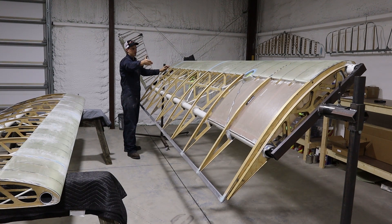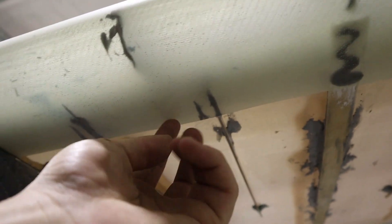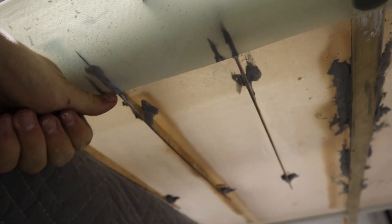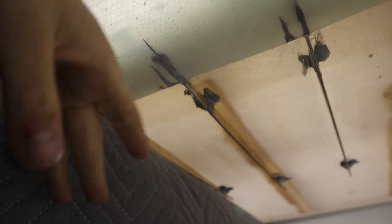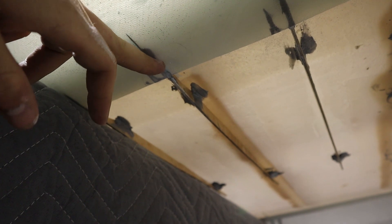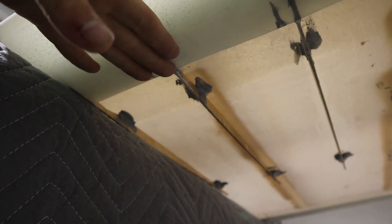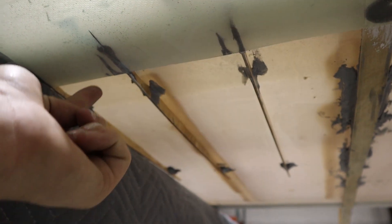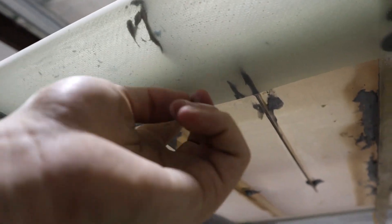The manual just says rib five. I'm assuming the wing in the past was shorter, so they haven't updated it since then, but that's how this works out. This little section of the leading edge was bowing out right here after I glued it, and I didn't notice until I pulled the tape off. The way I solved that problem was I cut a slit all the way up until the pressure relieved and that bow came out. I ended up having to sand down a little bit of material so they closed together all the way, then went in and filled it with body filler. That actually relieved the pressure — instead of having to cut out the high solid section, I just put a slit all the way up and filled it in. You can't even tell it's there. Perfectly smooth, and it made the bottom edge nice and uniform.